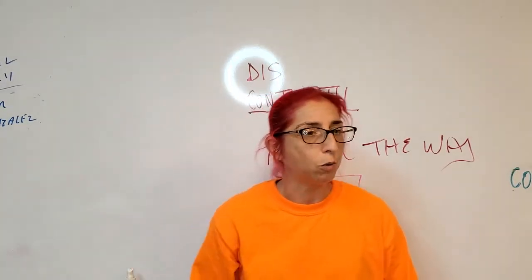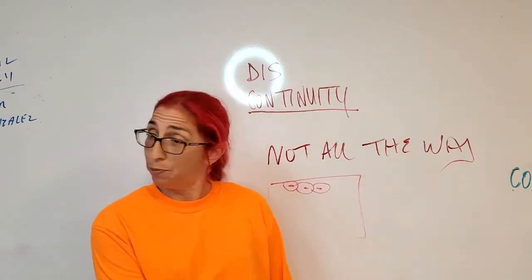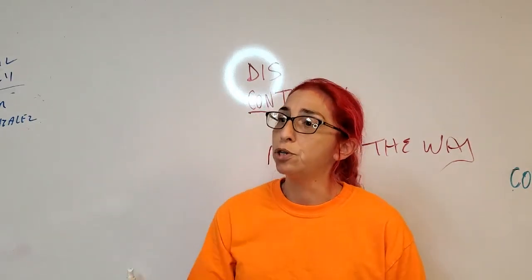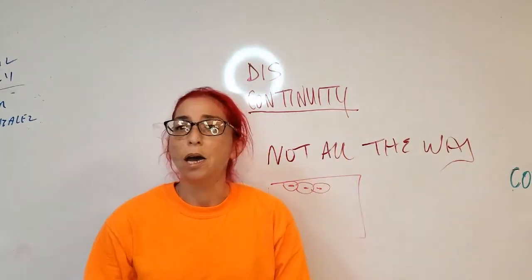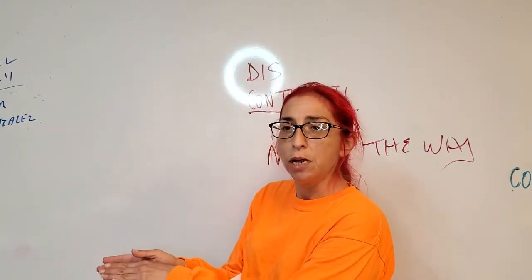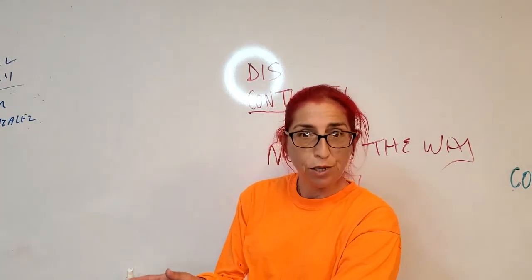Remember what we talked about last week, whether we had a good weld or a bad weld, right? Okay, some of that comes down to manipulation, right? Angle, travel speed, and my heat. This affects how I'm going to have fusion into my weld. This may also mean I sliced my weld open and I did not have correct bead placement. I can lack fusion because I wasn't able to place my bead correctly, okay? So we want to make sure that we're placing our bead correctly.